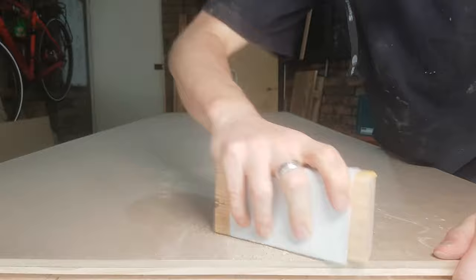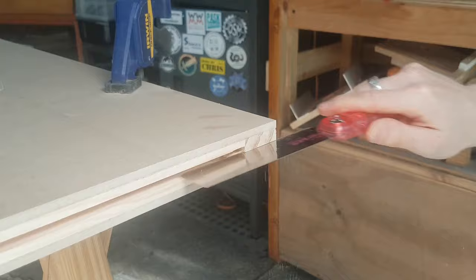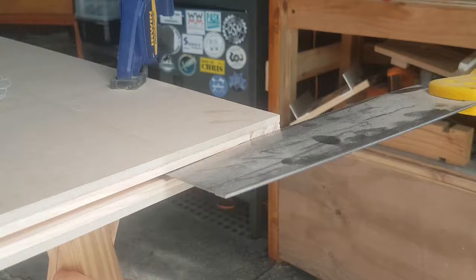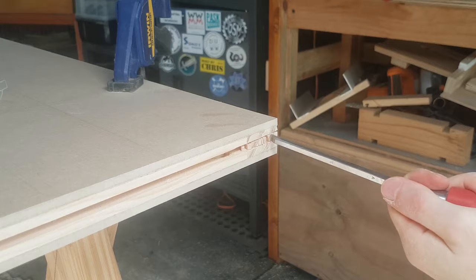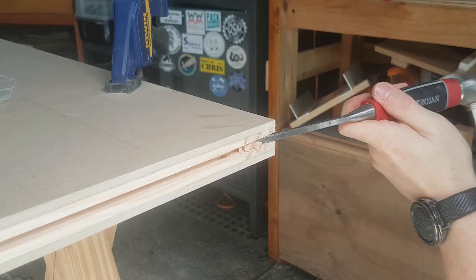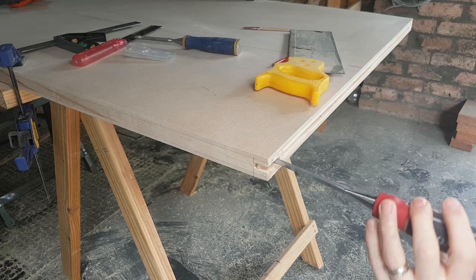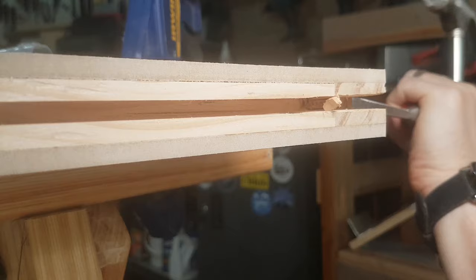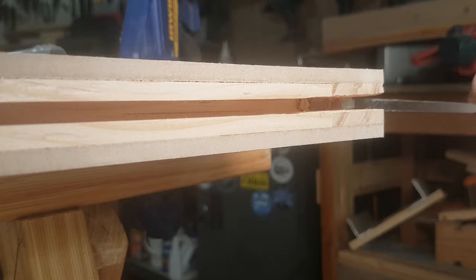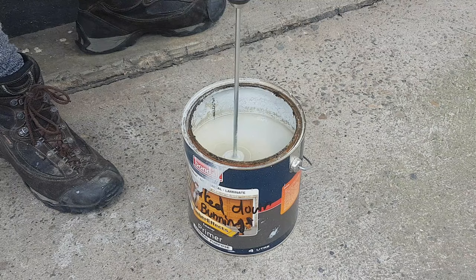Cleaning up the little ridge line between the two joined panels on the back of the door. That saw cost me about two dollars ten years ago, but this nice new little Japanese flush trim saw I got off Dave Stanton's channel — I love it, it is ten times sharper. It made quick work of an additional mortise. What these are for: on the routed edge I hadn't gone into the stiles, so I had to cut out one of them — but only one. On the second door I went to the other side, basically to hide that little groove from the casual observer, but also leaving the wood on one end to act as a stop — you'll see why that's important towards the end of the project. Sandpaper on a stick cleaned up what the chisel couldn't quite do, and that groove is lovely.